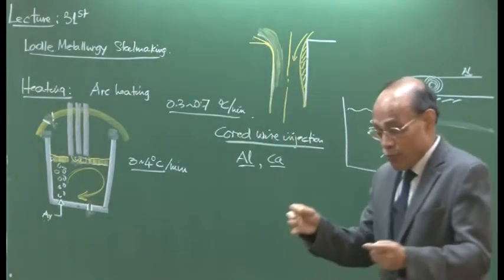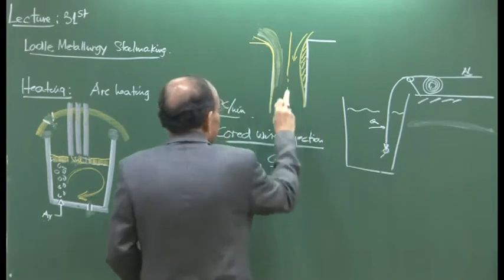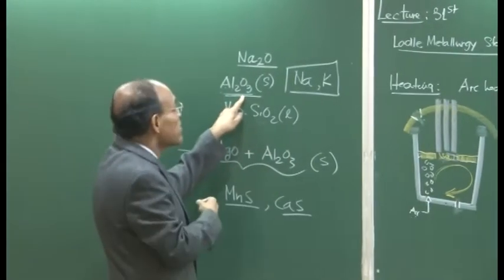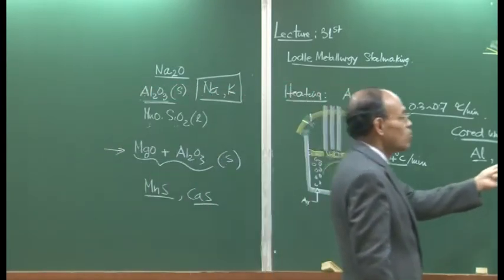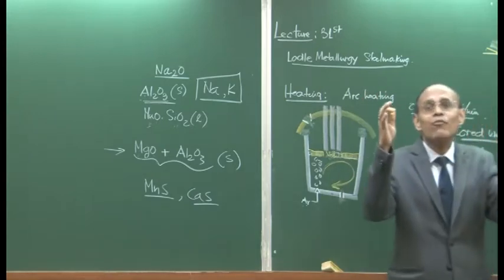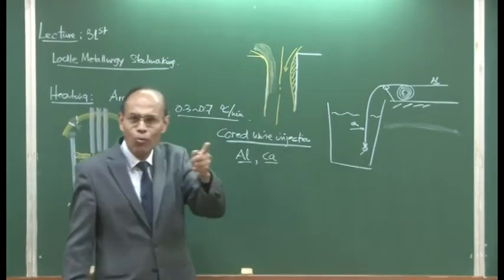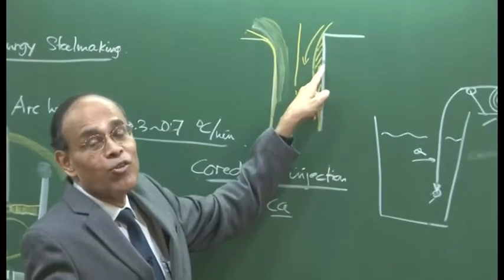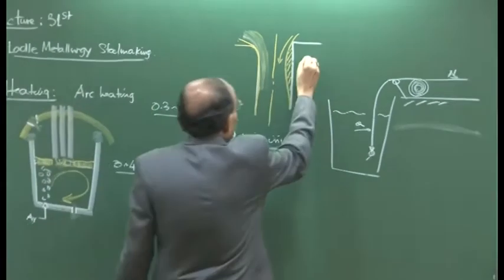Now, in the process of removal, a significant amount of Al2O3 inclusions is going to be generated. These solid inclusions can get deposited on the wall, and when such large amounts of alumina Al2O3 particles are generated in our effort to deoxidize the bath to a very large extent, there is naturally a danger of nozzle clogging. If you do not treat steel containing a large amount of Al2O3 inclusions, there is an invariable opportunity that you will have deposition in the nozzle. This is a well documented fact: people have taken samples from the industry, looked under the microscope, and seen a huge buildup of aluminium inclusions around the nozzle walls, through which the molten deoxidized metal flows from one vessel to another, or more specifically at the Tundish nozzle.